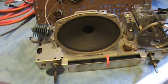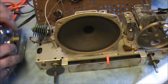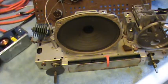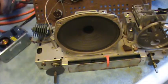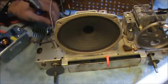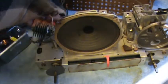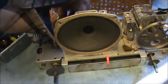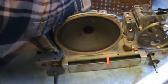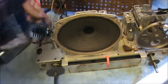So what I'm going to do is get out the dim bulb tester here. This is something you can build at home. There's a video on it on my channel. We'll hook up the cord here, and I'm kind of cheating. I'm using what's called the death cord. Do this at your own peril. Basically, it's a cord that bypasses the interlock. You really ought to have an isolation transformer if you're going to work on these. That would be a big help.